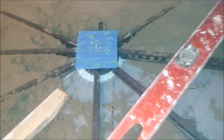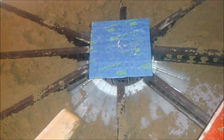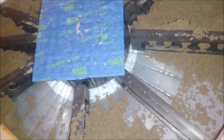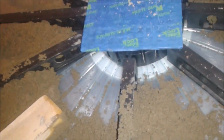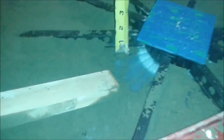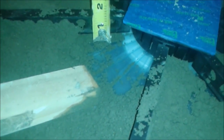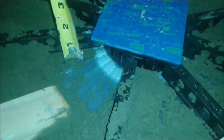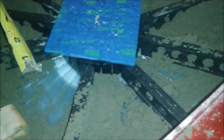Here at the center you can see I actually filled up the mud under the stick. This is important because the sticks, when they are close to the drain, are actually floating about a quarter of an inch, so it is important to fill up under them with mud as well. Next to the drain it should be one and a half inch, and you can see it is exactly one and a half inch — so it is good according to the standard and we are achieving what we want.